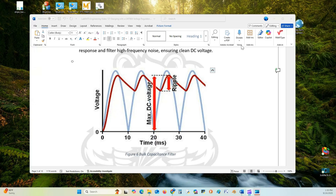The third part of the power supply is the bulk capacitance, which appears right after the full wave bridge rectifier. The light blue line is the positive peak of the sinusoidal input — half of the peak-to-peak voltage — with the negative side also shown. As that filters through the capacitor, charging and discharging, the time constant of the charge rate is much larger than the wavelength of the 120 hertz ripple. It is 120 hertz because it's 60 cycles times 2, giving you the small 120 hertz ripple.